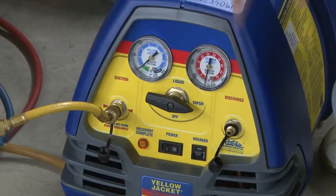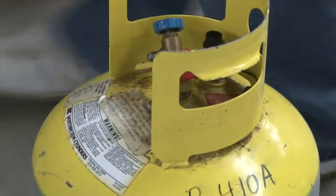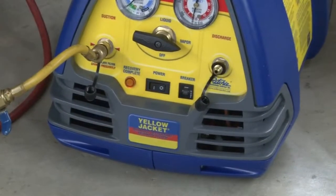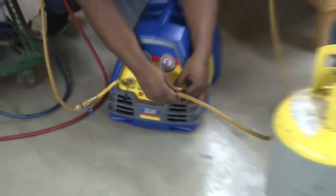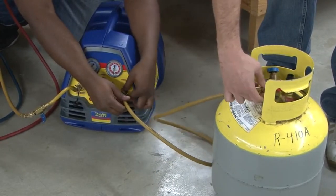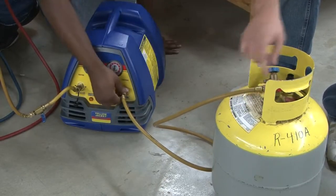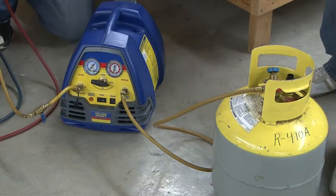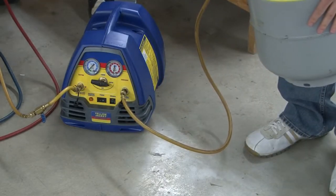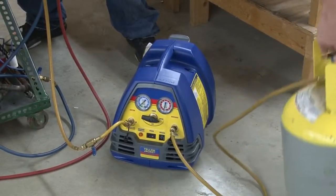That's going to give the system access to the recovery pump. We're going to pump the refrigerant from the system into this external tank. The last thing is to give it a discharge source to discharge into the tank. You can hook it to either side, but it's a little speedier if you hook it to the liquid side. It would also be speedier if we put this tank in ice or cooled it down somehow — when it's real hot outside, that's a pretty useful trick.